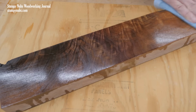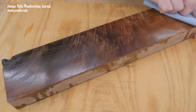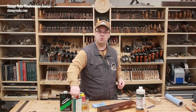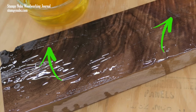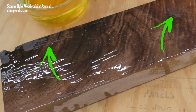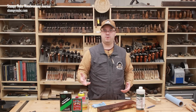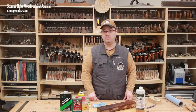How long should you wait to recoat? Well, that depends on the blend. Again, this can get confusing. Many blends say on the can that you can recoat in about 12 hours. They actually contain as much as 80% mineral spirits, and that evaporates very quickly. Those 12 hours are required for the added varnish resins to dry, not for the tung oil, which may make up only about 5% of what's in the can anyway.